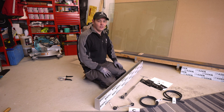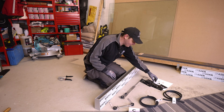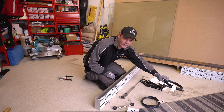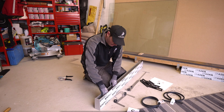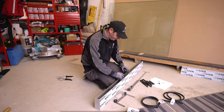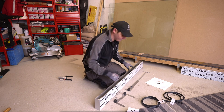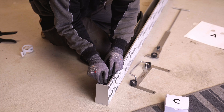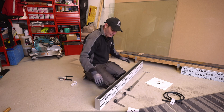We're going to go ahead and install the glass now. The flex fit system comes brilliantly labelled: A's are your wedges, B is your back gasket, C are your glass wedges that go down the front, and D is your finishing gasket on the other side. Dead easy, well thought out and well planned. First to go in are the glass wedges — on this particular system they go approximately on the hole centres, which is about 300mm. Push them down into the track and centralise them on the slider so they're all nice and even, then fit the B gasket over the top — it goes in really easy with no need for any lubricants. That's now ready to accept the glass.